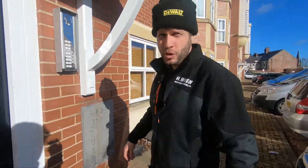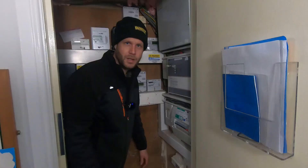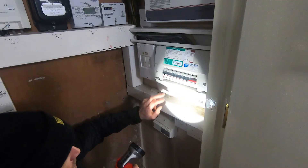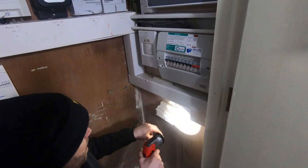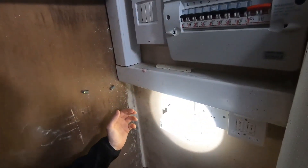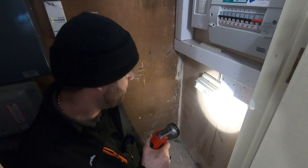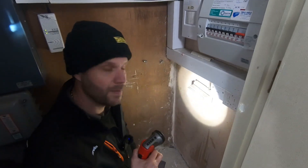Here we are, job two of the day. This intercom here, totally dead. So we'll check that out and see what's going on. That's that one resolved. We checked the breakers first, and there's a switch fuse spur for it. We checked there was power coming in - there's power supply. And I noticed this little fuse carrier had actually been popped out slightly - I don't know why, somebody's obviously interfered. Clicked that back in and we have power across there. Just tested it from the outside, job done. A nice quick five, ten minute job, all done.